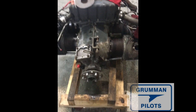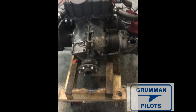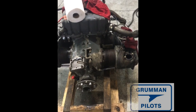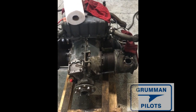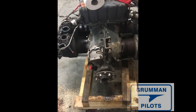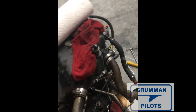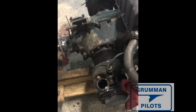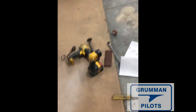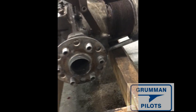All right, I think today is March 9th. This is Dawson's motor — a Lycoming. We've got it flipped upside down to pickle it, meaning put some oil in it so it doesn't rust while we wait to sandblast it and put it back on. Down here is the crankshaft, and these are the exhaust and air intakes for each cylinder — it's a four-cylinder. What was interesting is there's a plug that goes in right here on the crankshaft. It's a hollow crankshaft.